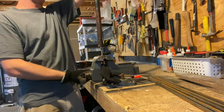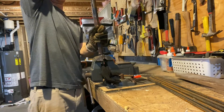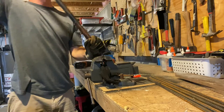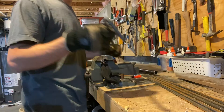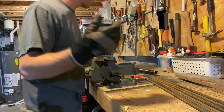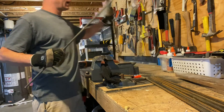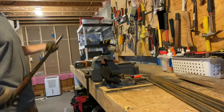I'm going to do a couple more here. Put it in, bend it down. Keep in mind: if it takes too much strength to bend for you, get a longer pipe. That increased leverage will decrease the pressure it takes to bend it.